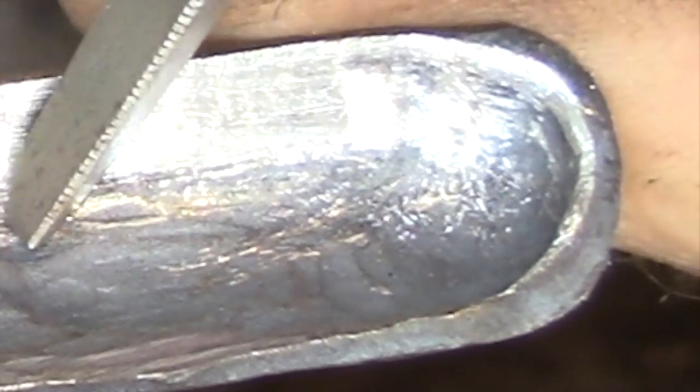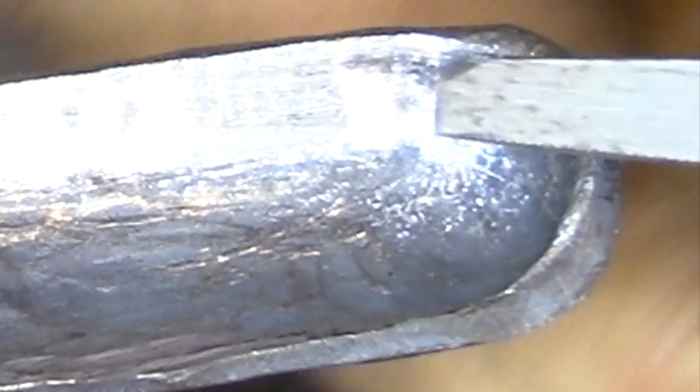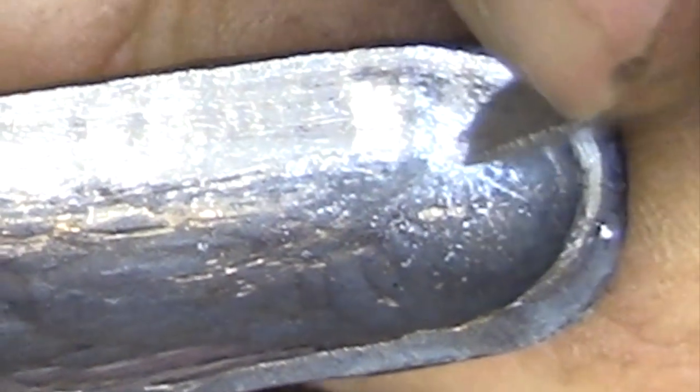Now, this is a pretty tough way to get rid of forging scale and hammer marks, but once you've got the inside surface clean, it would do a very nice job of just honing that edge back up to sharp. Of course, you can also use a Dremel tool with a grinding bit, or a slipstone or something that you have conform to this shape. But as a basic cutting tool that you can make and maintain yourself, this works amazingly well.